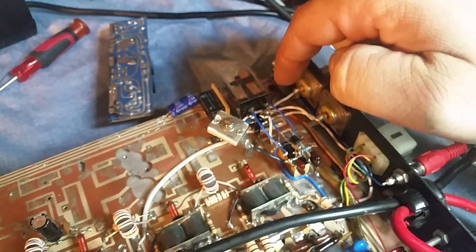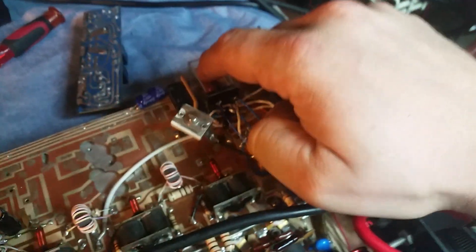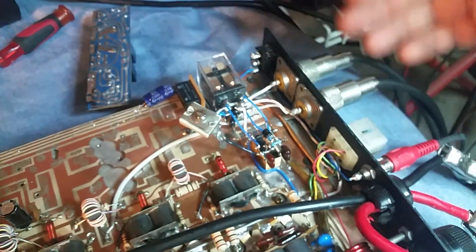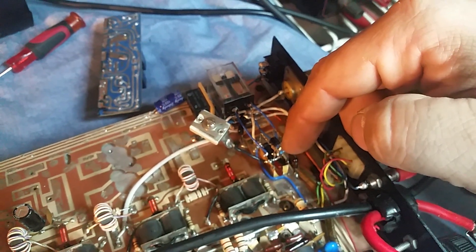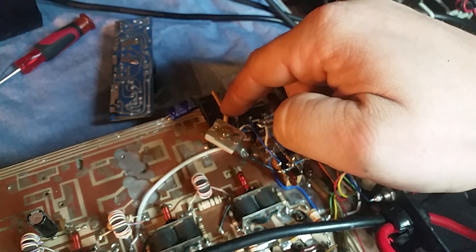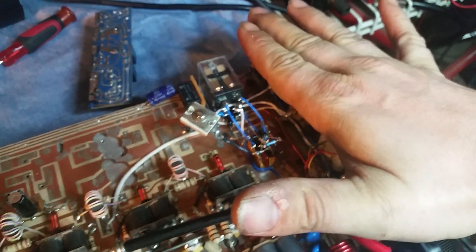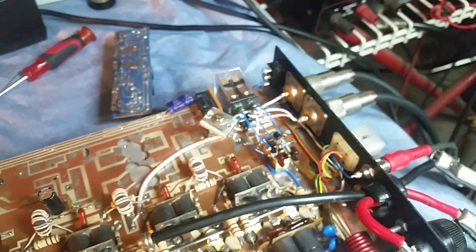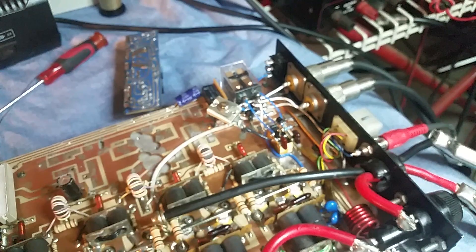The RF is coming in, going to the main relay right here, leaving this relay and traveling down this direction to the preamp section, through the jumper on the preamp section, back through the relay contacts, then back out the amp. There's a mismatch — it's causing a small slight mismatch, giving you a little bit of reflect just talking barefoot through here. Half a watt — probably not a big issue, but I'm about to tell you a little story where it did cause an issue.